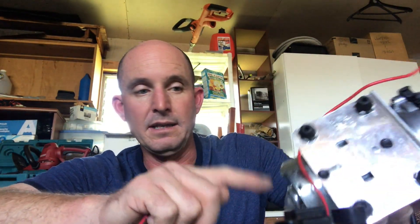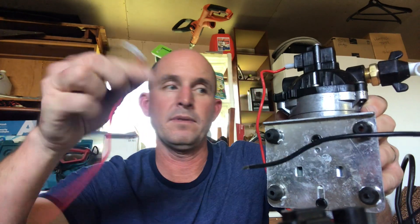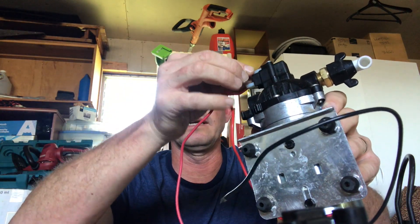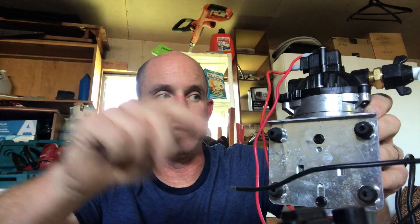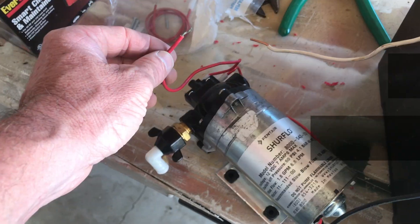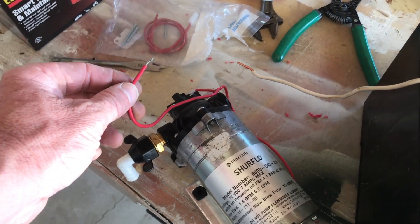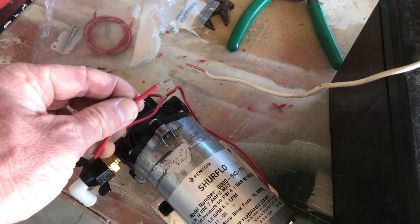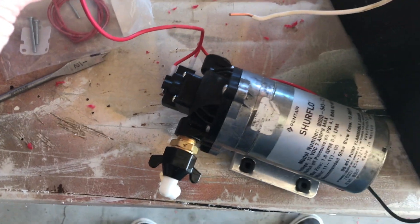We'll check it with a 12 volt adapter to make sure it's running before we attach water to it and the supply lines. As we reattach the electrical components, the positive feed that goes to the pump itself is in the lower connector. We have a new positive line for the switched area, so we attach this at the top connector — ground it and attach it into our switch mechanism. Now we've got our negative cable hooked up to the battery and another lead for a quick test. So we now have the new pressure sensor installed and a pump that is ready to be attached to the water supply.